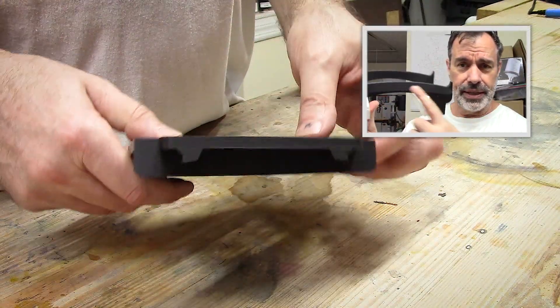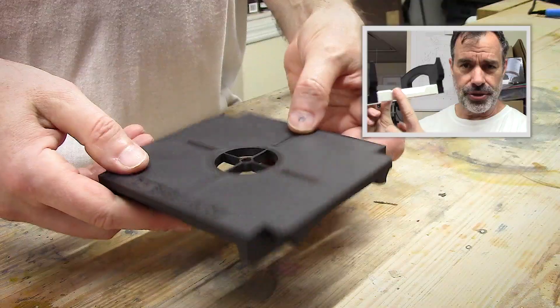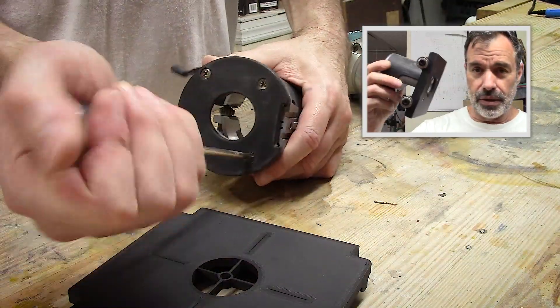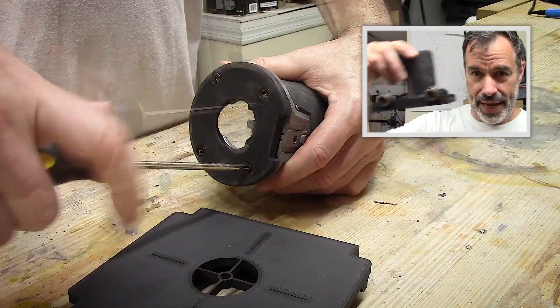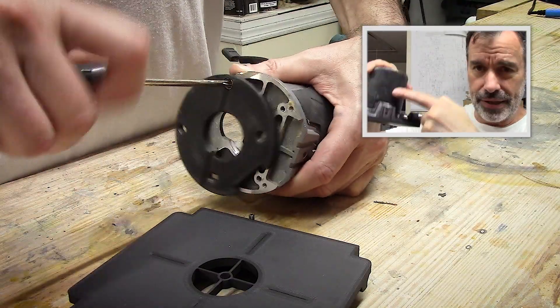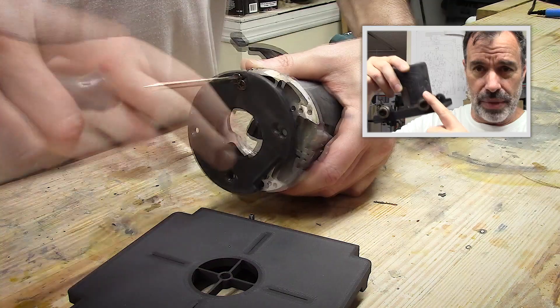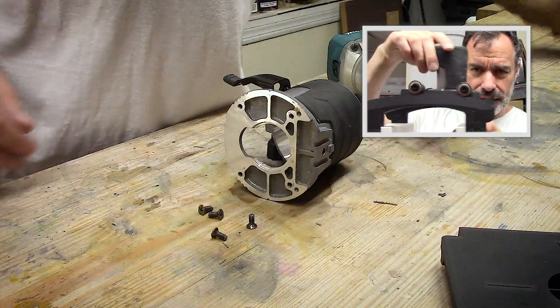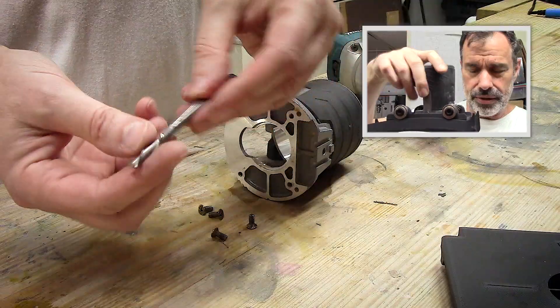We are assembling side rails and stretchers — that's what I'm calling them. We are doing bearing caddies, which is this part here. This is the caddy that connects to your router base. This one has bearings on it — skateboard bearings — and it will roll back and forth across the side arcs.